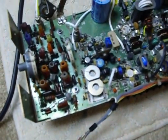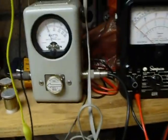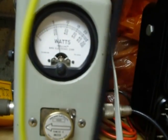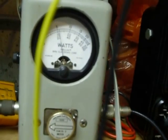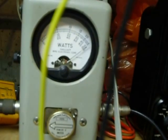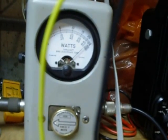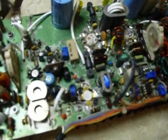I'm turning it on for the very first time as a test here on the workbench. With the ICOM turned all the way down we're showing 20 watts on the Bird meter. Just for fun, I'm going to kick the power up — there's our 100 watts output, no problem. In fact we can peg the meter, and this is on 160, which is the hardest one to get working on this.